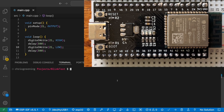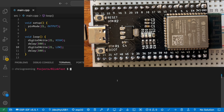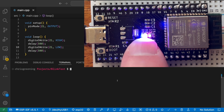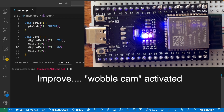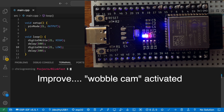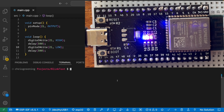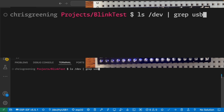So I've got the PCB plugged into a bit of breadboard just to hold it still. Let's try plugging it in and see if it works. So let's get the USB connector in. So far that's promising - we have two LEDs lit: a blue one and a red one. Hard to see in the video because the camera gets a bit washed out. Well, you can kind of see there's a blue and a red LED. Let's see if we actually enumerate - see if we have a USB device showing up.